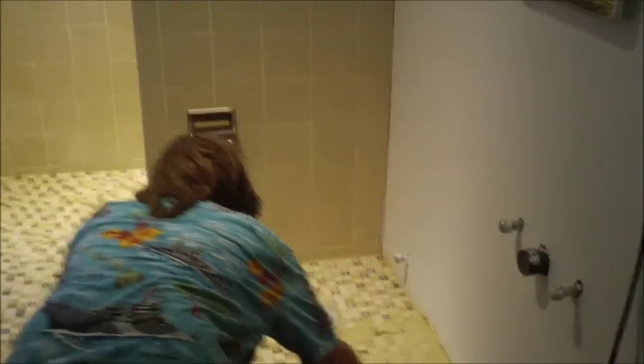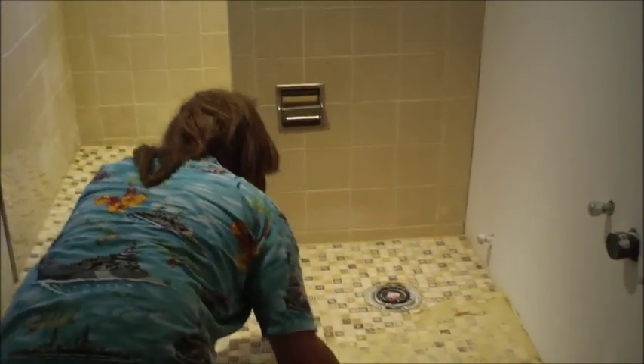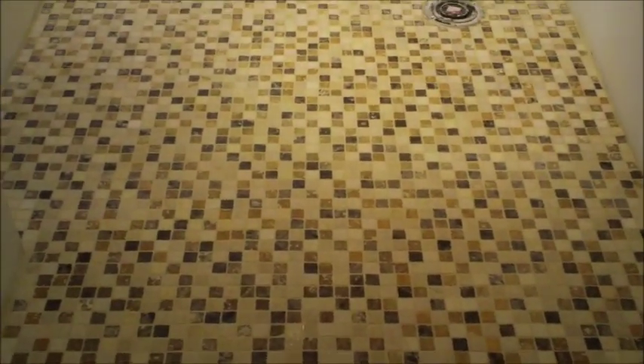I'm excited to see it coming together. I'll get you to snap a few pictures and we'll be all set — it looks beautiful. And just like that, in a little under an hour and a half, we're all grouted up. I've got the sponge mop now. What you want to do is make sure you get that haze off the top. I started in the shower stall and you can see how bright these tiles look — doesn't this look fantastic? Now that it's grouted up, it's ultra smooth and it's going to provide a really great surface. We'll finish mopping up and then we'll have a few final words on grouting.